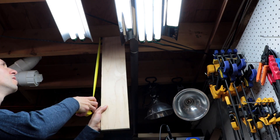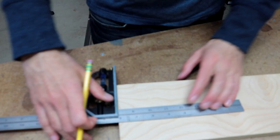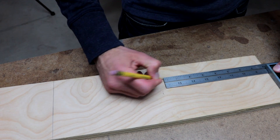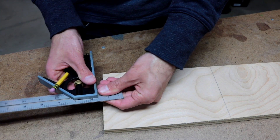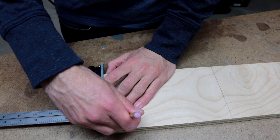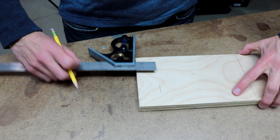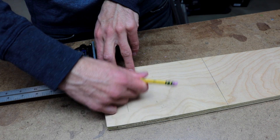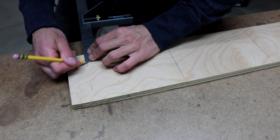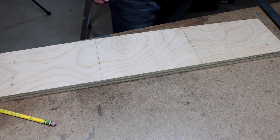Next you need to measure how far down you want your camera to be hanging. This will be different for everyone since your ceiling is probably not the same height as mine. I determined I needed an eight inch long piece of scrap wood which is four and three quarter inches wide, and I'll need two of them for both supports. Next you'll want to measure out where the center of your holes will go — these are the holes you'll feed the pipe through. My holes are an inch and a half from the bottom of the support. After you make your lines from the bottom, you'll want to make your lines from the side — I went with one inch from the side of the support. This is the center of the holes you're going to drill.